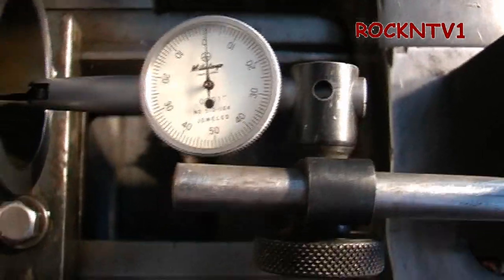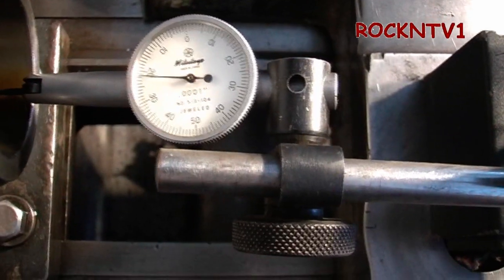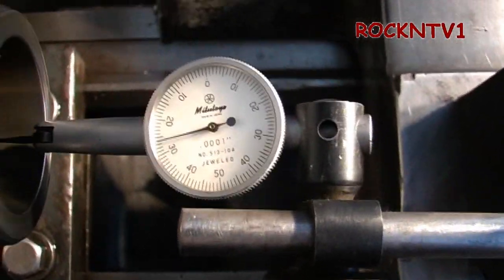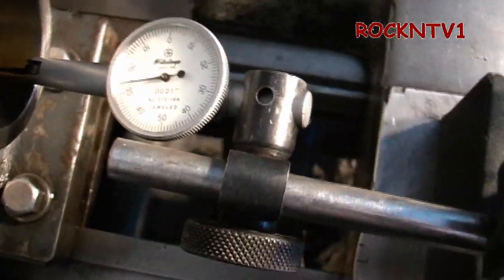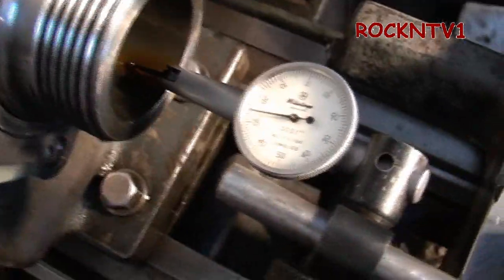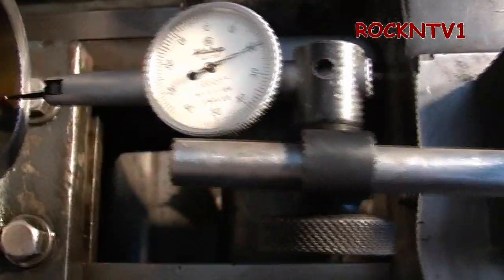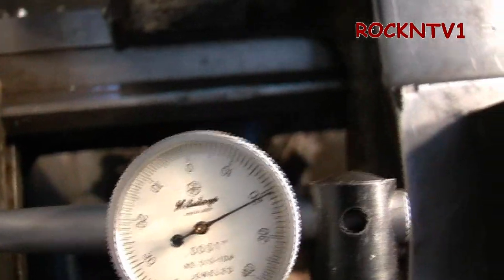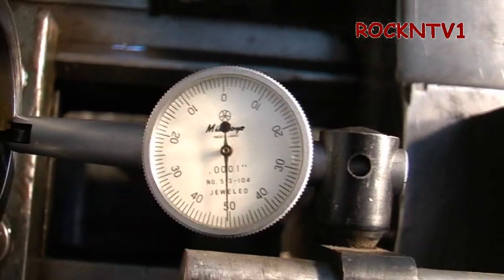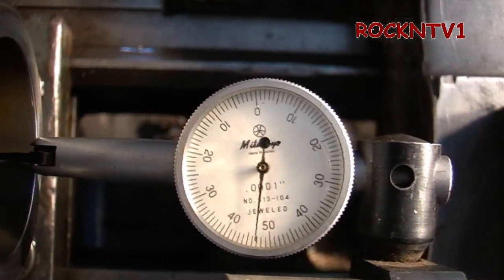I got about a tenth and a half of runout in there. You've got to be careful if you run a tenth indicator because that hole is tapered — it's many thousands over a half an inch or so. My runout is near the same. I cleaned that hole with alcohol, and because it is a tenth indicator, any imperfections in that hole at all are going to bounce that needle. So just a little squirt of penetrating oil gives that finger enough surface tension to stick in the hole good, and she follows nicely. Right now I probably got it unloaded — there, I think it's right on 50. I'm watching the dial and not the camera. You can see I'm well inside two tenths of a thousandth.